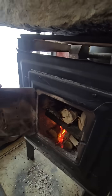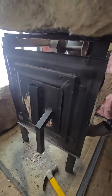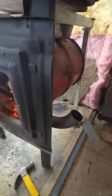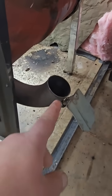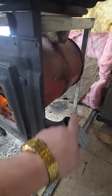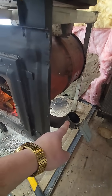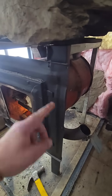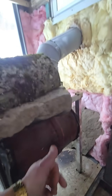You can see I've got a breaker box cover that I've used on the front here. But the most important thing about this wood stove is this air intake right here. I wanted to really experiment with that, so I made an air intake that in theory makes the air gain a lot of velocity as it travels through that tube, and there's a cyclone effect — like a turbo effect — as it swirls around and then goes up the pipe.